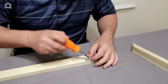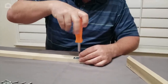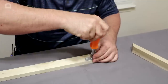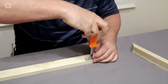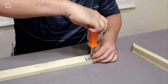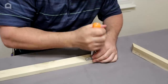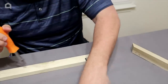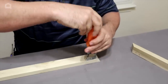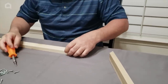Turn one of the frames right side up — it makes it easier than having to put the screw in while it's laying on its side. We did those starter holes, and what that's going to do is allow us to put these screws in on each corner and tighten them down. Make sure the screws and the corner braces do not penetrate or go through the whole piece — the last thing we want is any screw showing. That's the whole genius of a floating frame: you don't have to worry about seeing any screws, staples, nails, or anything like that. It just absolutely looks beautiful when it's done.